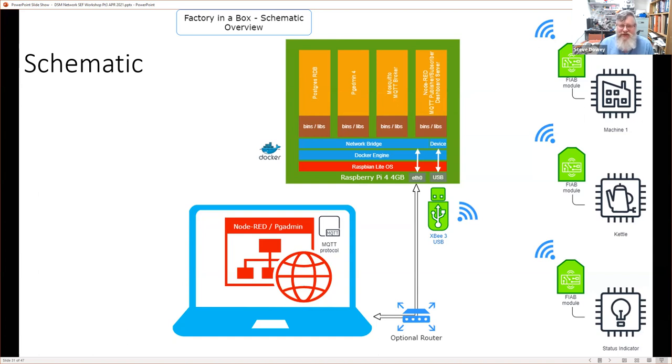And what it means is that for devices like this, if they use this MQTT protocol, we can potentially have a separate broker on another server on the network. And all the device does is register itself with the broker, and it publishes. That's all it does. It just sits there and publishes. Then at some other point, another machine might subscribe. And it subscribes via a topic. Again, we'll come into that a little bit later on.